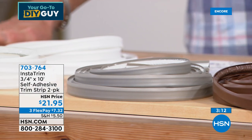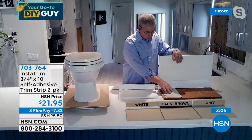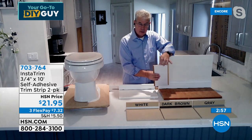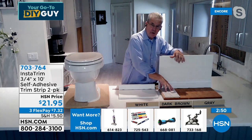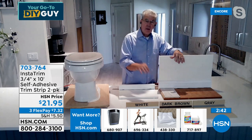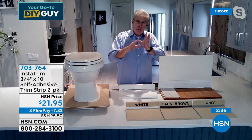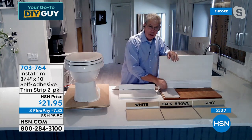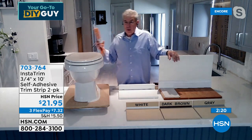Throughout this renovation house, they have laminate floors. Laminate has a soft pad on the back, and when put up next to molding, it constantly moves. Put caulk in there and in six months it's going to crack and look ugly. With the InstaTrim, the adhesive goes into the corner, but the wings — those flaps — have no adhesive, allowing for that movement. You can't stop movement, caulk doesn't stop it, but InstaTrim allows it. Once you do this, it's a very permanent fix to a long-time problem.